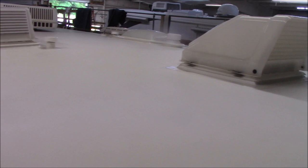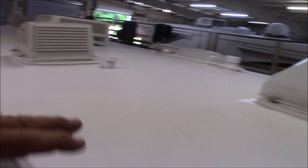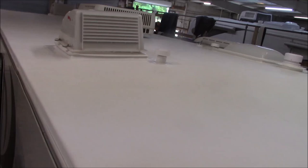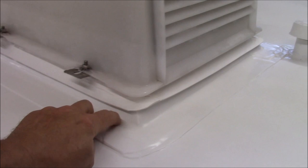This is a TPO roof — it's a 60 mil commercial grade TPO roof. All of this is heat welded. If you were to Google flat roof images, you'll see the vents, the air conditioners, those components all lifted up off the roof line — elevated on a curb. They also have flashing and counter flashing, and that's all these curbs. I custom make them — they all have flashing and counter flashing.